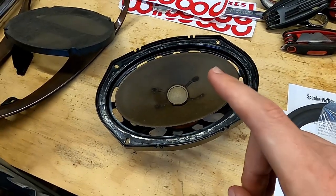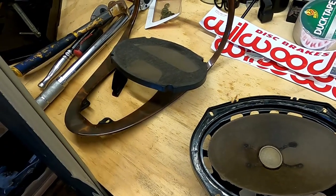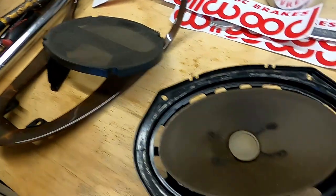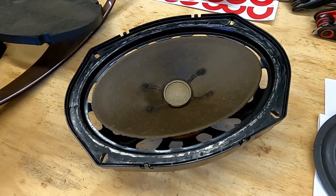The last part was shaving down the outer surface as well. I think the whole assembly is paper material, so I've taken the top surface and shaved a layer away. I tried to make sure it was relatively smooth, and using a glue means a roughed up surface on the paper is actually probably a good thing. The next step — no pressure — is gluing the foam to the speaker body and the cone itself, and then also gluing the extra top grill piece to the top of the foam.